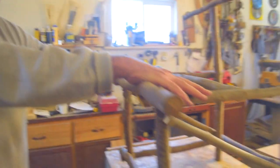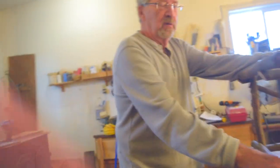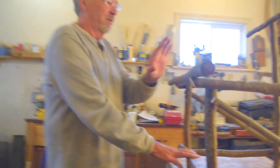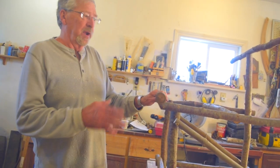It's pretty simple — it took about 15 to 20 minutes. But I've done a few of these so I don't have to think about it. They're all the same: front leg, back leg, cross pieces — two of them — an angle brace. Across the front we've got two pieces, across the back we've got two pieces. It's a pretty basic frame for a chair.